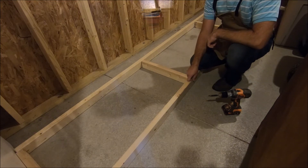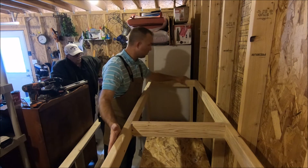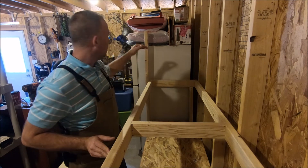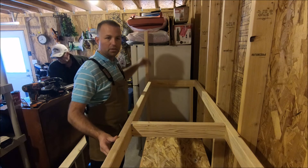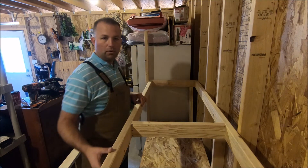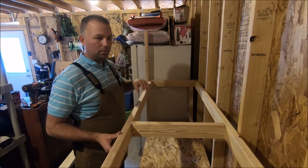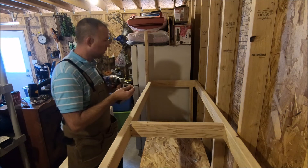We'll get these put together. So we got the first layer down. All I did was I have these little spacer pieces — they're 20 inches tall. I put this box right where I want it at 20 inches, and then I just reuse the spacers to get them all at 20 inches. That ends up putting the top of the shelf at 24 inches each one. This end piece is cut to six foot, so it's mounted on each shelf and then the top shelf will be flush. Now what we're doing is putting these boxes on here and screwing them into the studs once we level it off, then we'll just keep going up to the next layer. We have an eight-foot piece of plywood and a four-foot piece cut to go on here — four-foot by two-foot and eight-foot by two-foot. Right now I'm going to screw in this box into the wall here and show you how this goes.